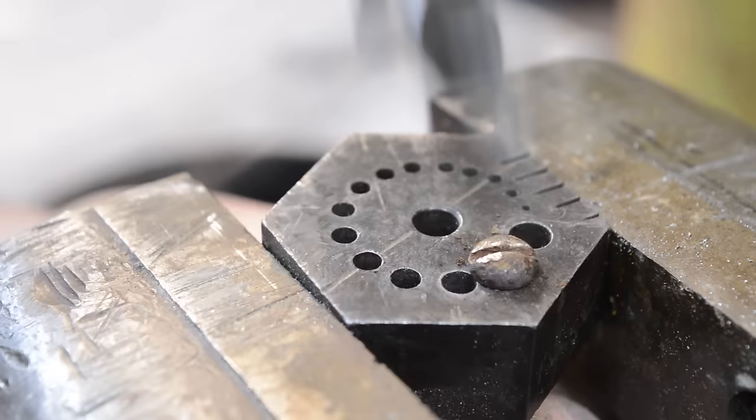Just about there. And it'll run through this color. If it goes to a really light bluish gray, you got to polish it down and start over again. Here we go. Now it's starting to turn blue. Throw it down here on the towel. Get a relight. You got to argue that is a little sexier looking than what we started out with. Anyway, just do all the screws on the gun the same way.